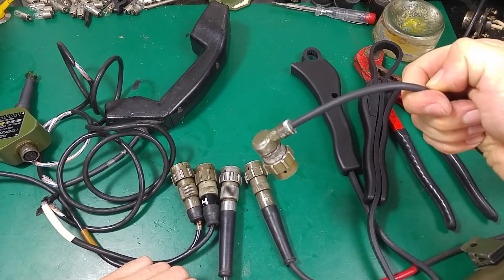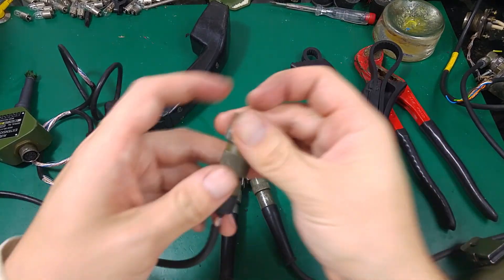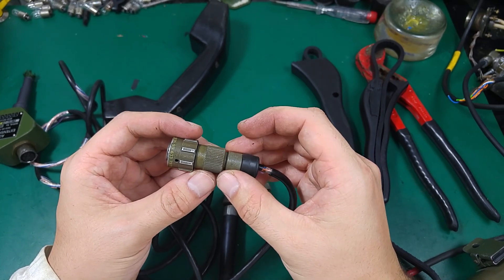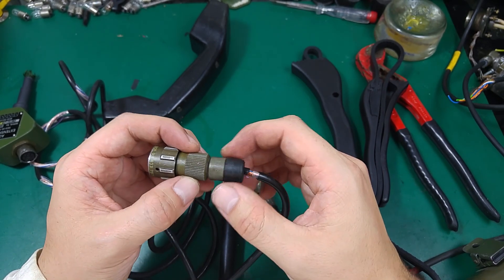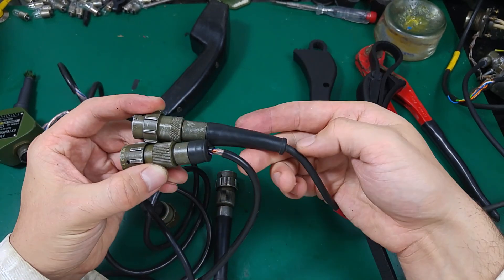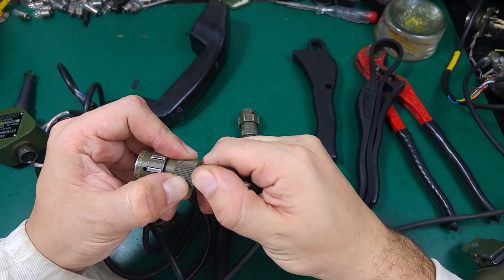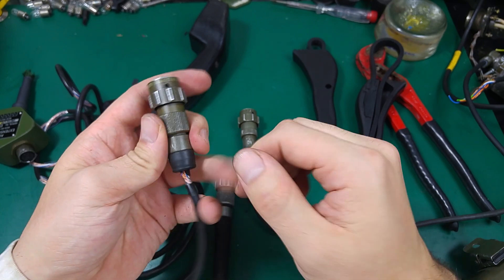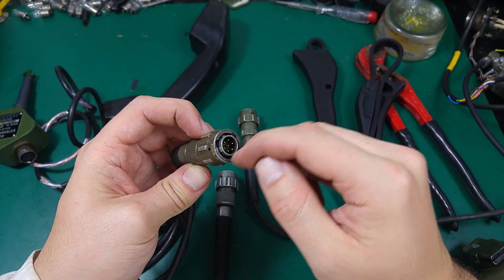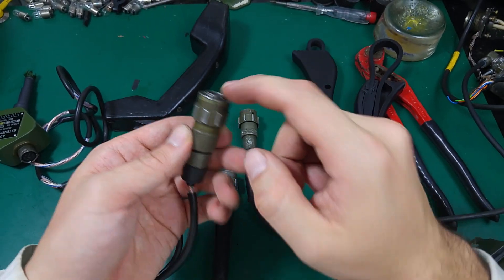So what is the plug made from? We've got two elements that need to be unscrewed. The first one is a strain relief, which can be longer or shorter, but it just needs to be unscrewed from the central element. After that, we need to unscrew the internal element that is held between that part and the center one.